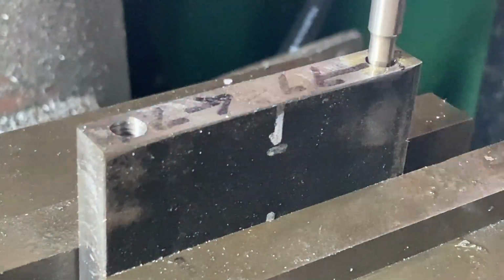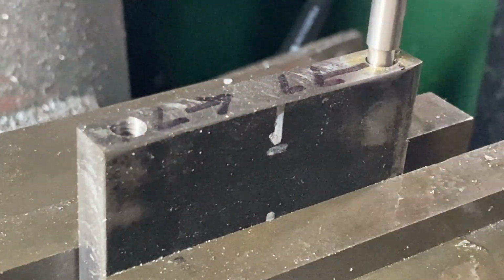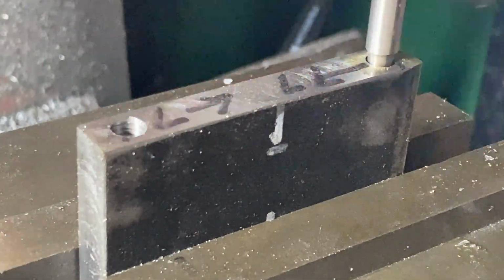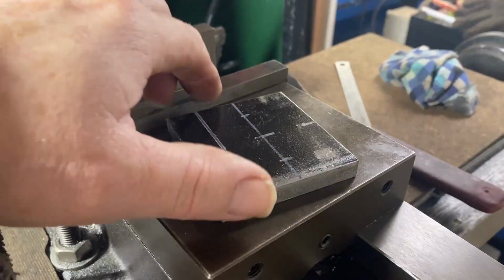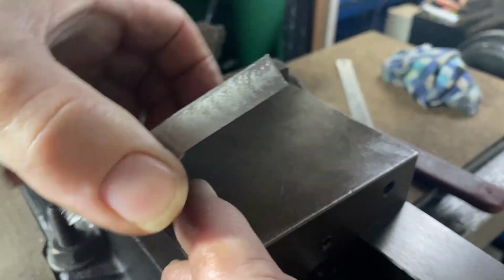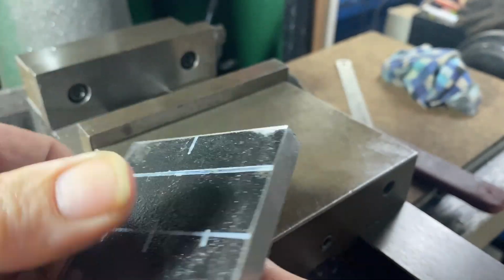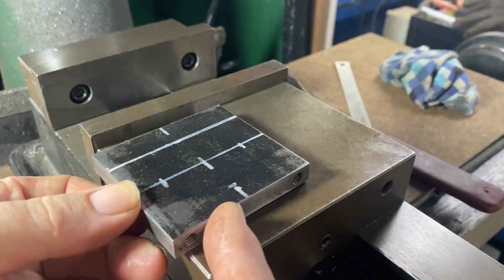in half, and I need these tapped holes to go past the halfway line so that I can tap the rest of the hole later on. These 2 holes here hold both sides of the clamp together, and these are the really deep holes that I've gone past halfway. The holes in the back will hold part of the clamp onto the housing of the rig.